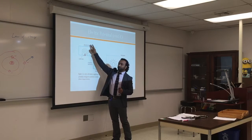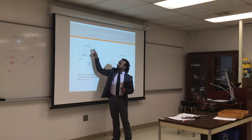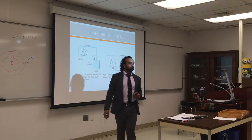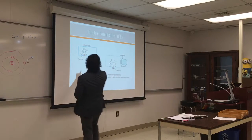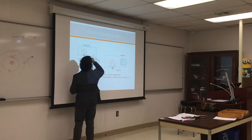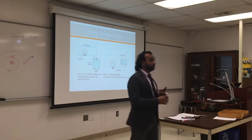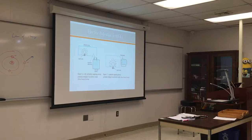If you have any cut in that circuit, it's not going to work. If I have a cut here, how come the light bulb is not on, even though it's getting power? There's no circuit. Keep that in mind. You can get power all the way here, but there's no neutral, there's no way back, and it's not running. Remember that, because when you do troubleshooting, you're going to check the power from the receptacle all the way to the components. It has power, but it's not running. Is it broken? Am I going to replace it? Check your neutral. Make sure that the way back is running.